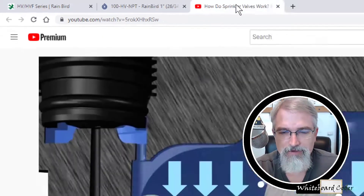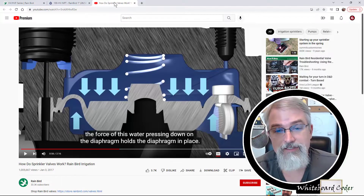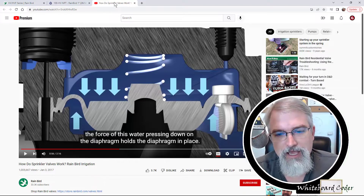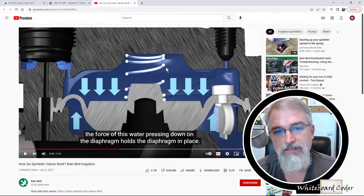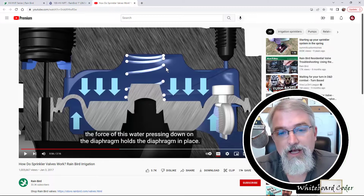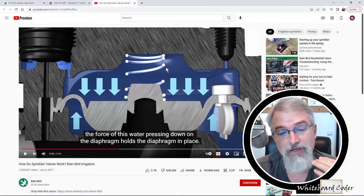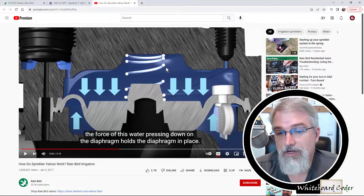Here's the next thing: if you're having some problem with your flow, go watch this video. Rainbird did a great video and I'll put a link to it that just shows how this valve works — I think it's probably how most of their valves work. Basically, we have this diaphragm up here, which has all this pressure pushing down, then that valve releases the pressure so there's less pressure sealing it, and that allows the water to flow through. I have a feeling my seal is not sealing well, and luckily I believe I can take the guts out of a new one and swap them for the guts of the old one. I don't have to cut any pipe or remove anything — I can just reuse what I have.